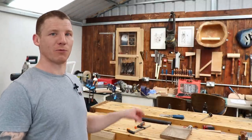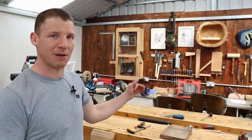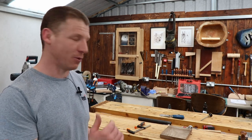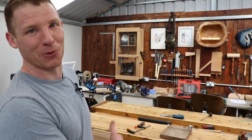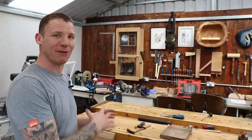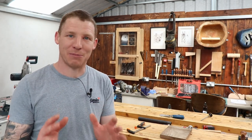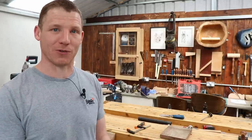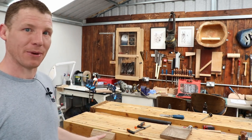There is a certain amount of slip built into this so we don't have the same clamping force as the last two videos, but if we need extremely strong clamping force I've added holes in the back of the tenon bar that we can put a bar into. I haven't needed it yet but it's there. Now, 99% of you understood the purpose of this — we're trying to build a fully functioning leg vise with powerful clamping force made completely from timber that anybody in their home workshop can build.